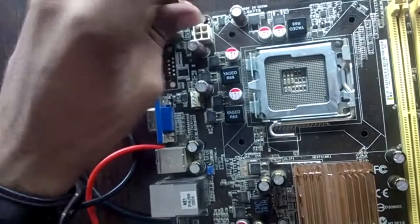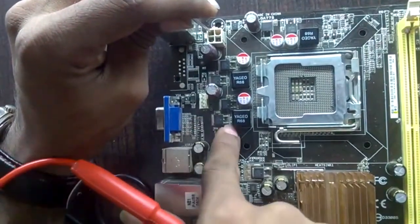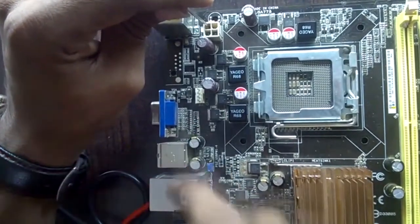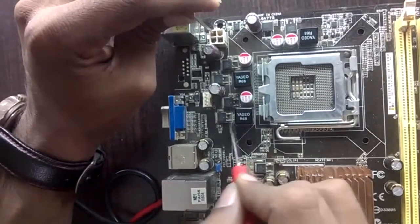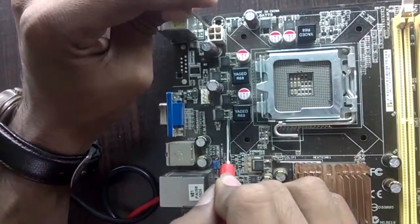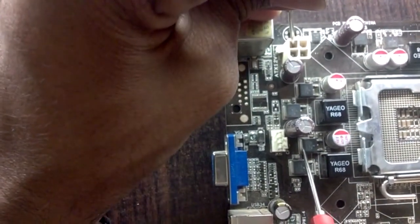Put the probe in the supply slot — supply comes on the drain of the TG MOSFET as we saw in the theory lecture. The left side leg is always the gate, the right side is the source, and the upper side is always the drain. So when we test this drain and it gives continuity with supply, it is a TG MOSFET.